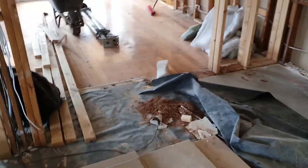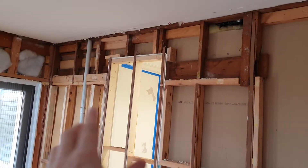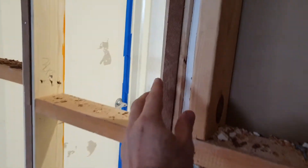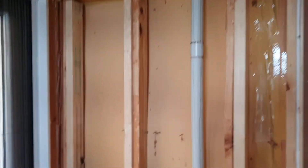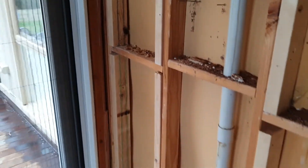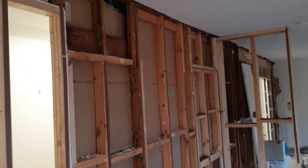As I mentioned in my last video, down here you used to enter the hallway here. So we've actually framed that in now and then straightened that wall. You can see all the packers on the walls - all this individual packing. We've blocked out some of that there. You can see how this timber is sticking out further than this - that's to basically straighten the wall. So we put those bits of timber in so that the wall ends up really nice and straight. That whole wall there has been straightened.